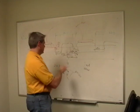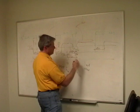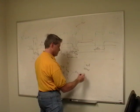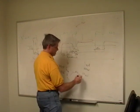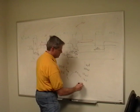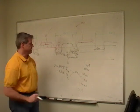Really 101, right, because we have this extra, but then he comes into here, and he flows through this guy's base, and then we multiply that times 100, and now we've got 10 microamps, and that flows back into here, and now I've got 1 milliamp, and that flows back into here, and I've got 100 milliamps, and that flows back into here, and I've got 10 amps, and I've got a bad thing going on, don't I?